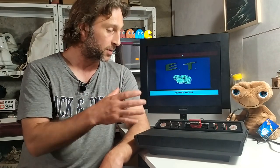And I think a kit like that is handy to have around a workshop if ever you're repairing units and you want to test quickly if a unit is giving a signal, for example, if the RF modulator is broken in some way, or if it's only got a SCART out and you don't want to go to the trouble of making a SCART cable without knowing if there is actually a signal coming from the unit or not. Or again, if you just want to composite mod a known working system. So they're handy to have around.